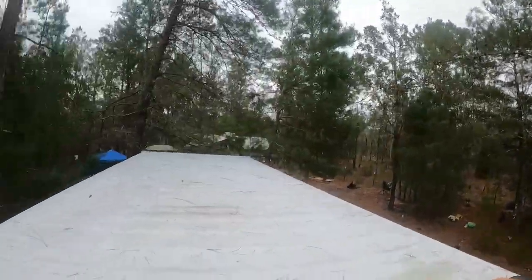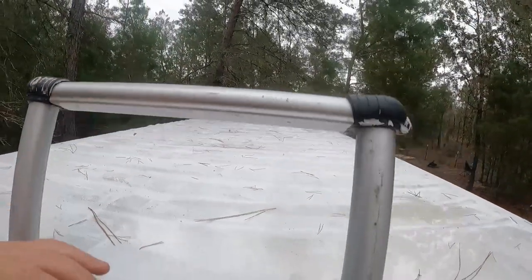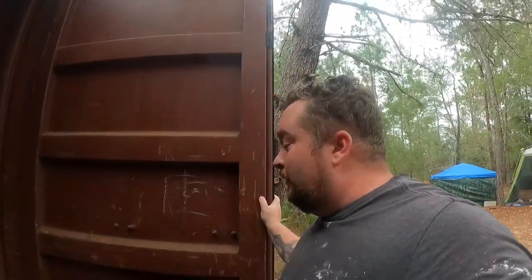That first coat has dried — this is the next day. It obviously needs probably two more coats; you can definitely see it coming through in places. But it looks a ton better than it did already, so two more coats should do it. I'll take the blower to clear debris and probably knock out both coats tomorrow so the roof will be done. Hopefully it'll be a lot cooler in there too. Somebody on a container page said some people add supports to pitch the roof for drainage, but once this elastomeric coating is dried on, pooling water doesn't matter since it's rated for that.